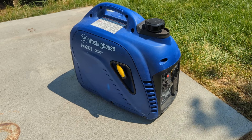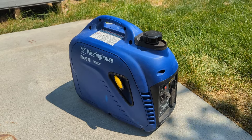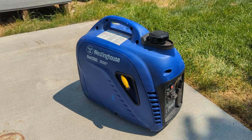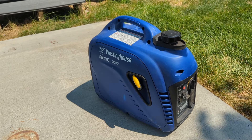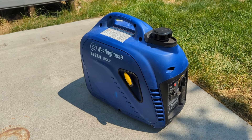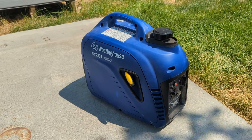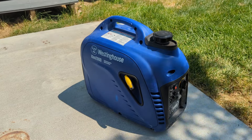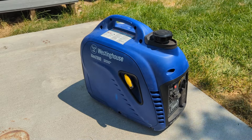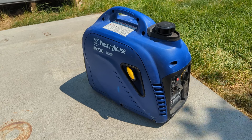For my final thoughts: we actually experienced a power outage where we were without power for about 10 hours and ran this the whole time. This little thing powered both our fridge — a large dual compressor fridge — and kept our deep freezer running, plus charged our phones. It definitely saved us during that power outage; we had a lot of meat in the deep freeze that would have spoiled, so it was worth its weight in gold. Do I recommend this over a Honda? I would say yes. It starts very easily — not always a one-pull start, sometimes two or three pulls if it's been a couple of weeks.